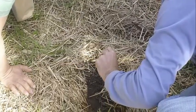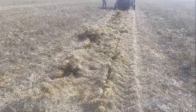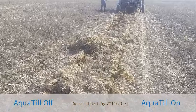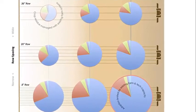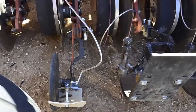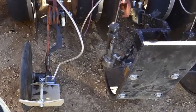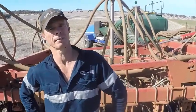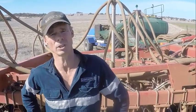AquaTool technology has the capacity to cut through crop residue. However, we must also consider the cost and logistics of deployment. To do this, we've built an operational and economic model based on parameters including the row spacing, ground speed, nozzle size, cost of fuel, and other various parameters. In terms of the different waterjets, are you thinking there are viable mechanisms within the range that would suit your operation in terms of cost and logistics? I think so, yes — particularly if you can use it as a liquid delivery system as well with the nutrients within that stream, it makes a lot of sense that the cost is not just for cutting straw.